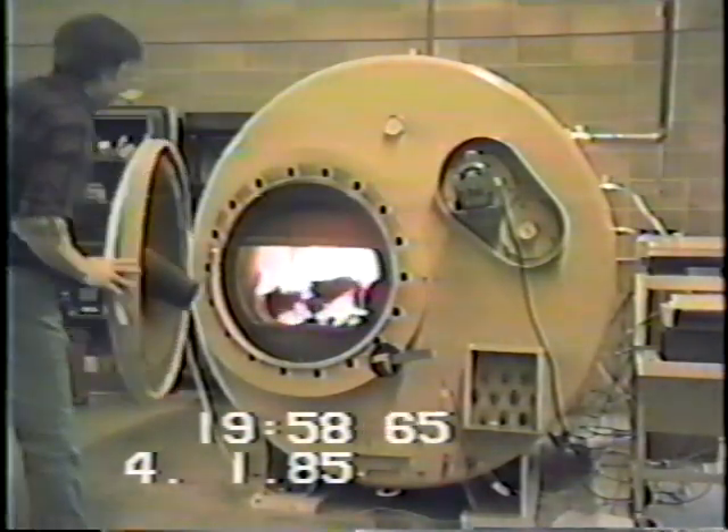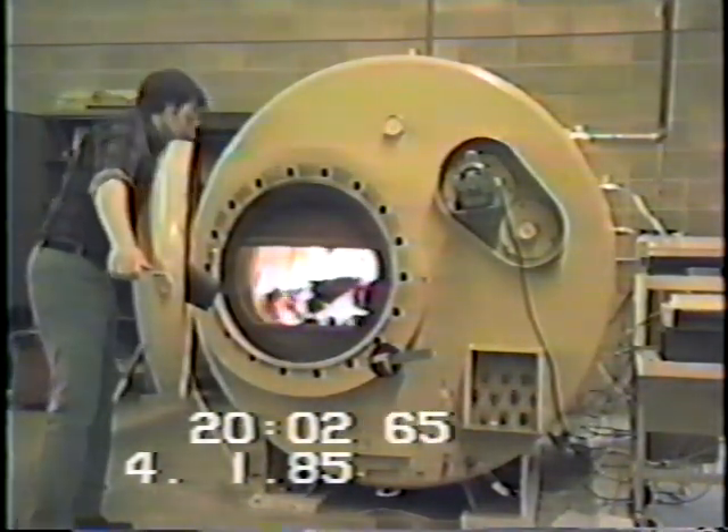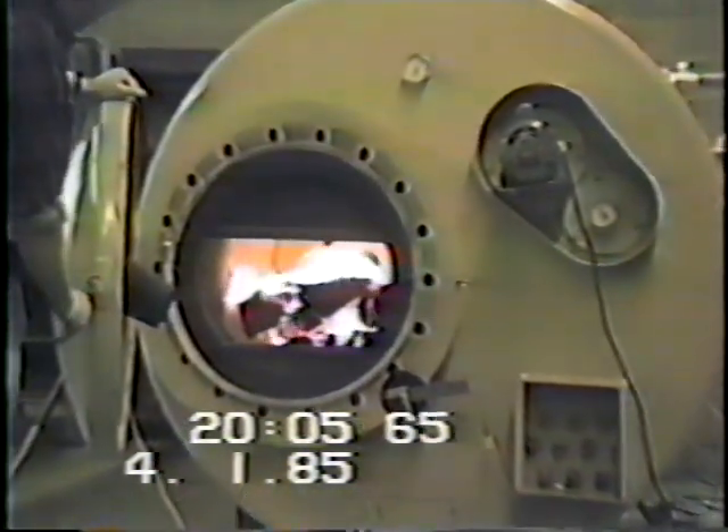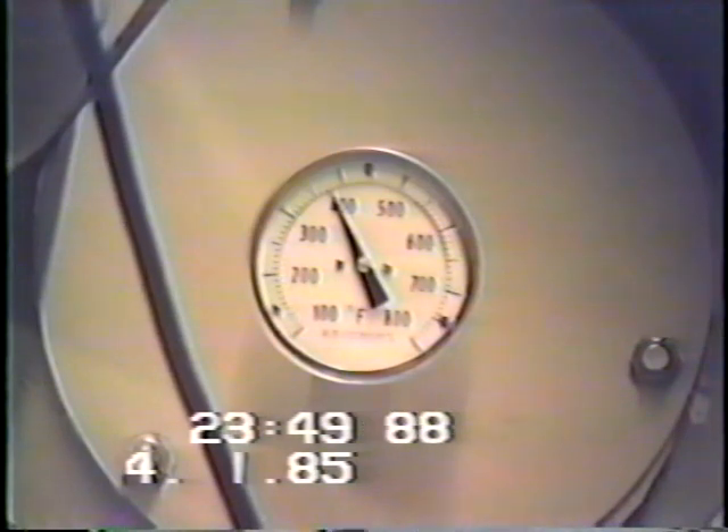We can increase performance by pushing the wood away from the nozzle so that we get better dispersion of air. Notice how the flames are being pulled into the secondary combustion chamber by the very strong induced draft. It is the combination of this excess air and the extreme temperatures that produces the clean burn. We're burning in the 1,200 to 1,300 degree range, and our exhaust temperatures are about 375 degrees before they leave our unit.